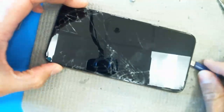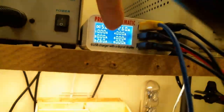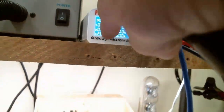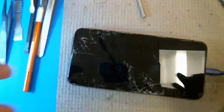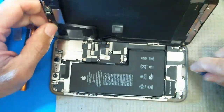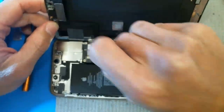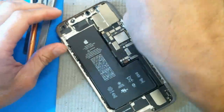The red numbers on the schematics show the drop in voltage. So if it says 0.64, then it's a 0.64 volt drop across that pin. That allows you to diagnose and repair — you compare the diode mode readings on ZXW Tools versus what you're actually getting, and if something is off, that tells you that line is bad. The first thing I always do is plug it in — it's getting 2.6 amps, which is normal. That tells me the phone is working; it just has no display. So I solely focus on the LCD connector, because it's probably something wrong with that.